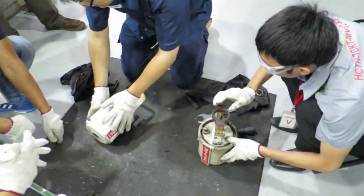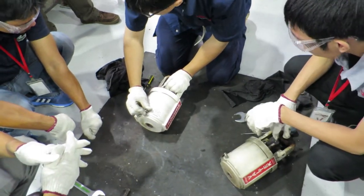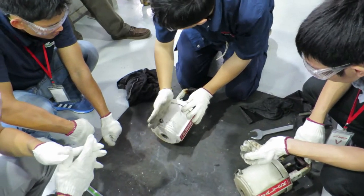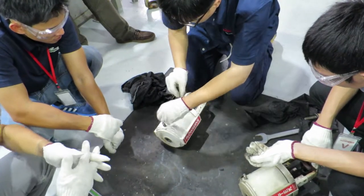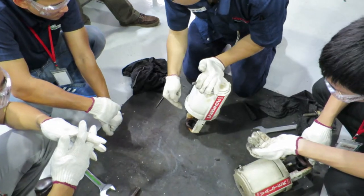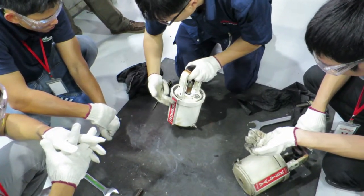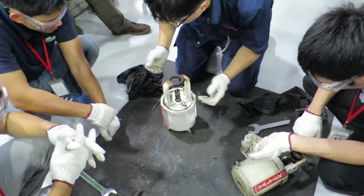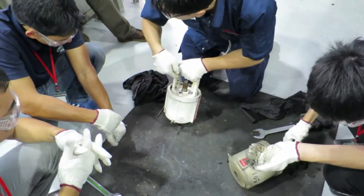Now by looking at the actuator, you can see here is one input, this is the second input. They always have the same line. This is a normal configuration. I would say 90% of the configurations have them on the same side, facing the same side. You can see this yoke is aligned with this sticker. When you want to do assembly, just remember to line this line to this line.